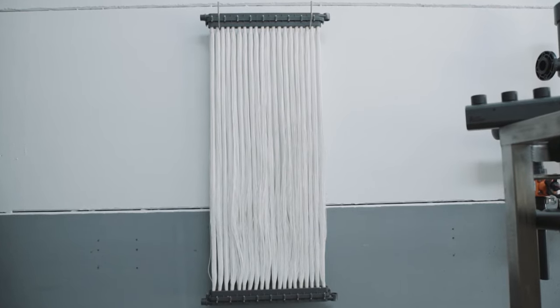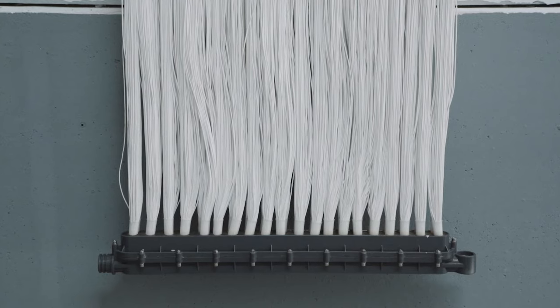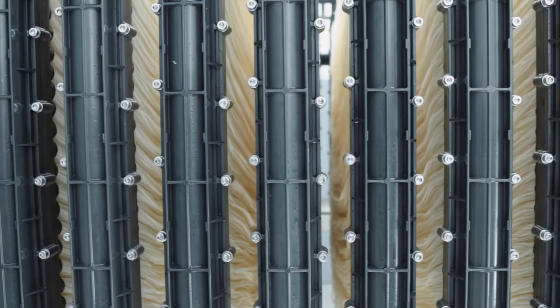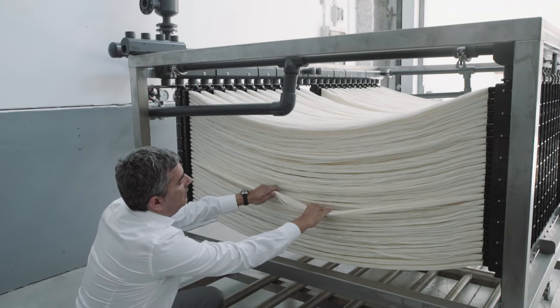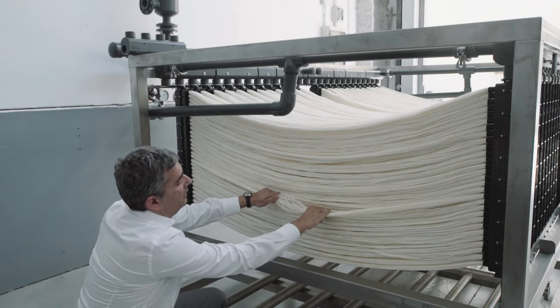In vertical disposition, the air collides against the collectors that become barriers causing buildup of sludge. When our membrane bundles are in water, they expand. That way, the scouring bubbles can reach efficiently all the capillaries.